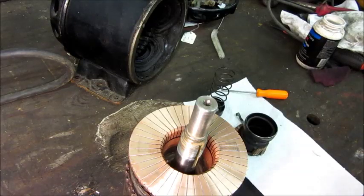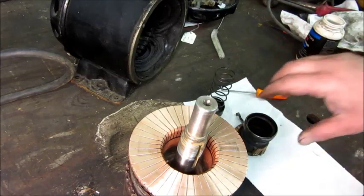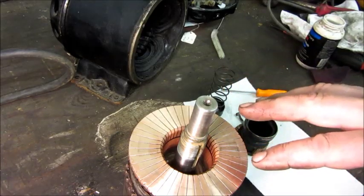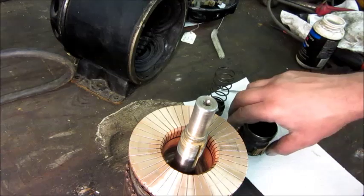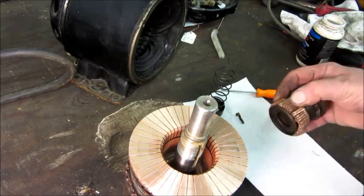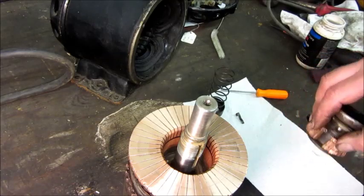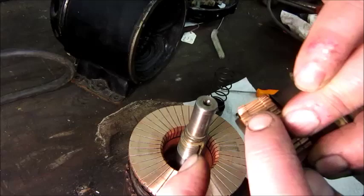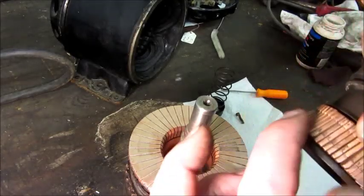The memory card filled up while I was putting the silicone grease in there. This had a lot of heavy green corrosion in it — I'm sure that came from sulfur dioxide, because this motor was driving a sulfur dioxide compressor. Over the years that would have leaked and corroded it. I've ensured that the step side with the two raised ends is out.